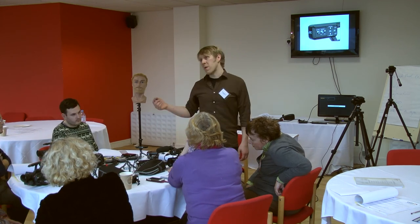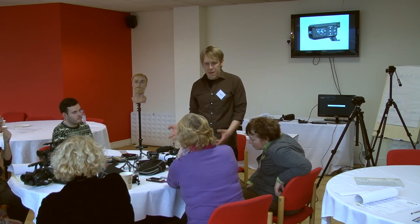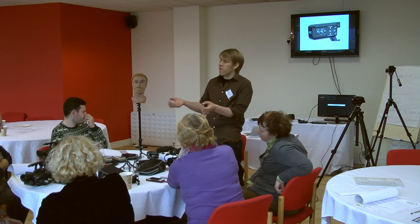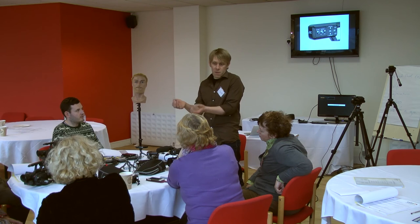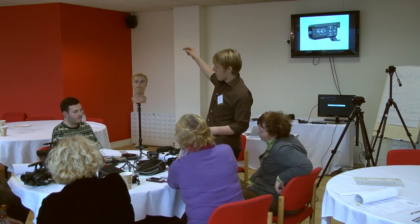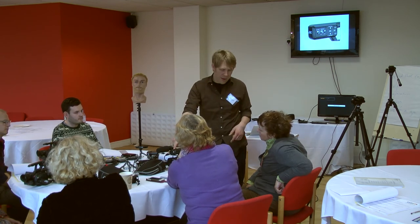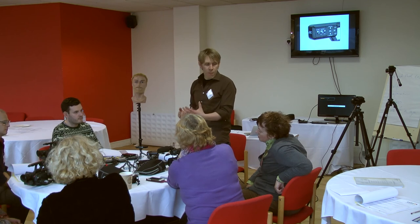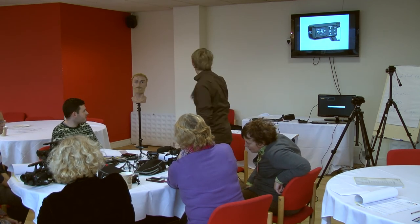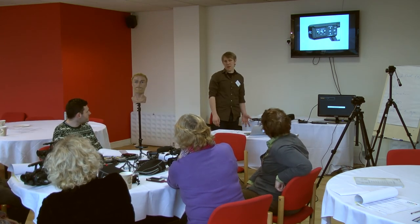Line is when you're drawing a line level from something like a sound mixer or a mixing desk. So if you went to a theatre and you were filming a performance, or if you were filming a lecture in a big lecture room and they've got a proper PA system, you could take a sound line from the mixing desk directly into the camera and get the sound from their microphones. But nine times out of ten, we'd be on mic. Nine times out of ten, you'll be having mic plus 48 volts because directional mics tend to need power.